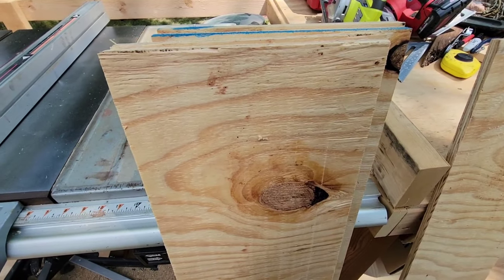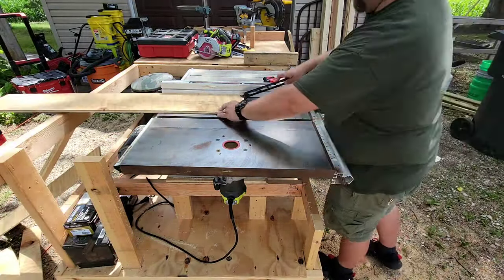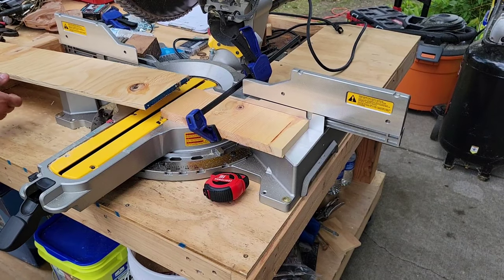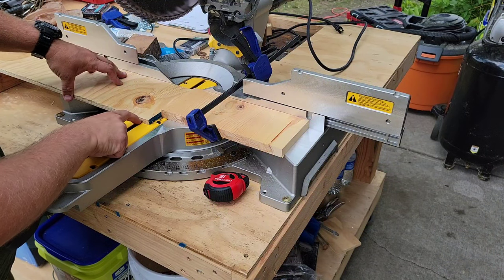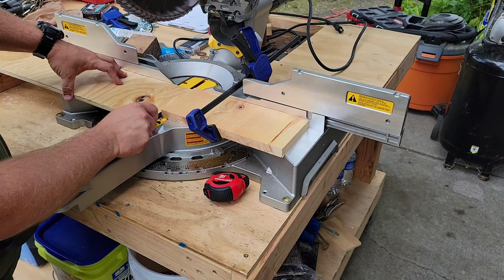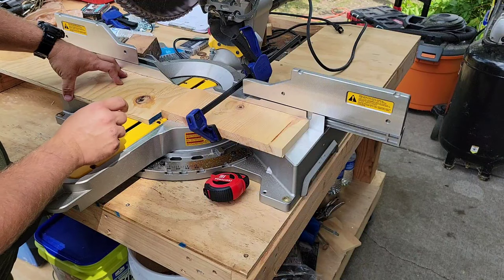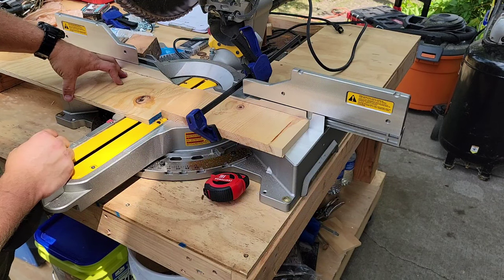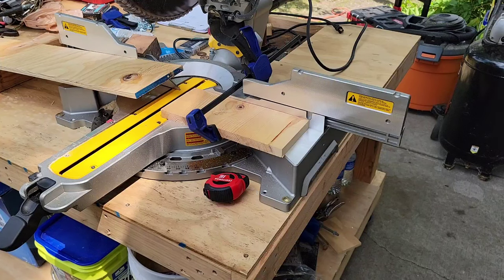I measured one inch from the blade to the block, which gives me one-inch cuts. You want this accurate, repeatable, and consistent — one inch. If it's thinner it won't space the legs out as much; if it's thicker it will. If you start gaining and losing length it'll make the legs twist. I've experimented with a few different lengths and one inch seems to work the best both short-term and long-term.